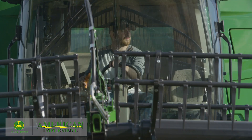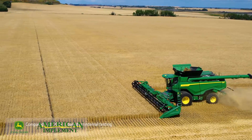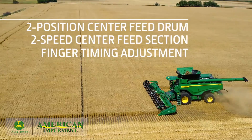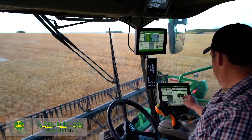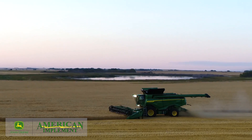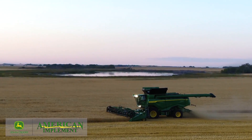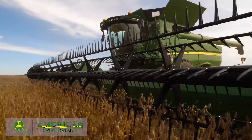When changing crops or conditions, you'll reduce your downtime from 4 hours to just 20 minutes, thanks to the easy-to-adjust feed rate speed, drum height, and finger timing. To ensure smooth crop feeding, you can change the speed of the feed drum and center feed belt to high or low. For example, the low speed in soybeans will help prevent the crop from being thrown over the header.